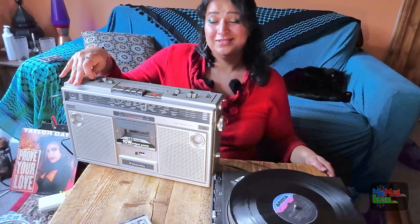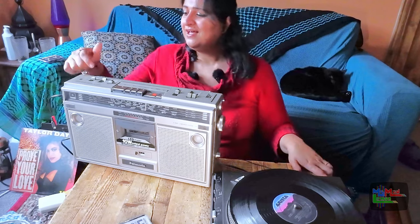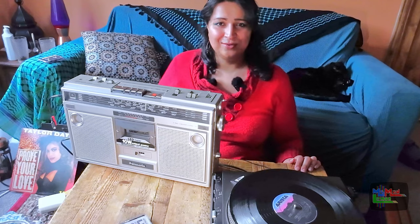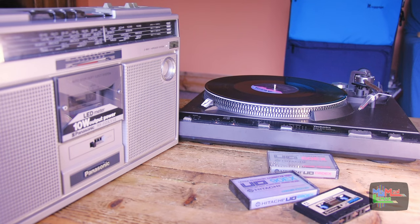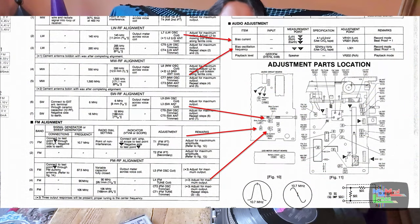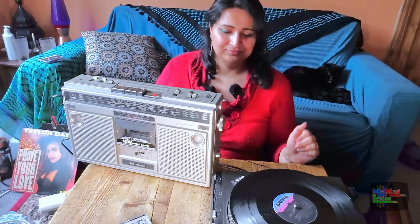This takes normal position tapes, ferrochrome — which gives me the clue of the era it's from, late 70s, early 80s — and chrome. So we've got a chrome tape here. At first I was a bit skeptical thinking, are these boomboxes really chrome capable, or is it just the equalization — the treble turned up a little? But when I went inside it, I did see bias controls on the head. So yes, I believe it now. It is actually a chrome recorder.